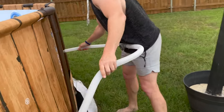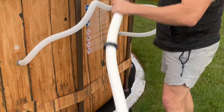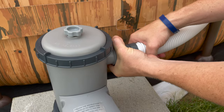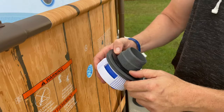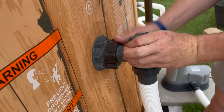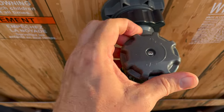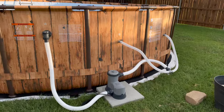On the outside where the hoses attach, it'll be marked clearly with the letter B. Use the provided clamps to make sure those are on tight so you don't have any leaks at the inlets. Then take one of the larger hoses, connect one end to the bottom of the T-connector and the other end to the part of the pump marked with the letter B. Connect the other hose to the side marked with the letter A, which will be your outlet, then connect the outlet valve to the other end of that hose. Install the outlet to the inside of the pool, making sure the rubber O-ring is on the inside. Tighten the outlet as much as you can and install the valve. The outlet valve has a lock and unlock position — make sure it's unlocked when the pump is in use and locked when you're changing the filter so water doesn't flow back into the pump.